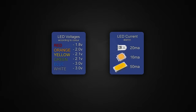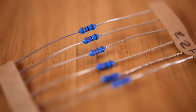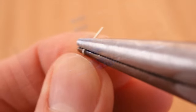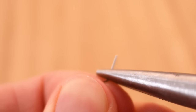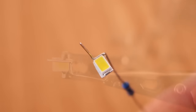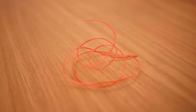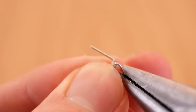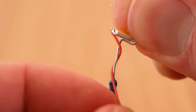If you don't know your LED's required voltage and current, you can use this chart to get an approximate value. So now we've got our resistors, we can solder them to the LEDs. But first, we'll bend one end of a resistor's leg over, making a right angle, and then bend it back up again like this. Now we can solder either end of an LED to this notch. The little antenna sticking up will act as a support for a mushroom dome later. Now we need to get a length of thin wire, no less than 20cm long, and solder one end of it to the other side of the LED.